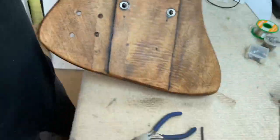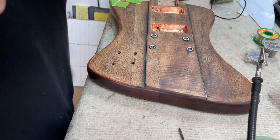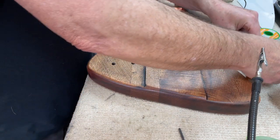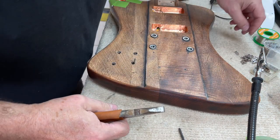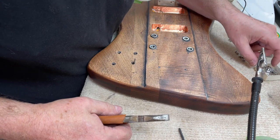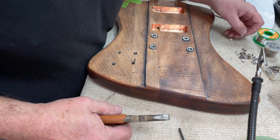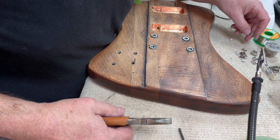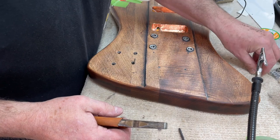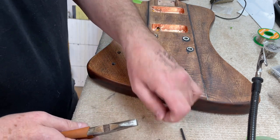ground points. And for that matter, what I use for ground points is a piece of metal that is completely useless, that I don't like, that I've inherited from other guitars, and it's these butterfly string trees, which I really like reusing when it comes to ground points on other guitars. So I get a smallish one of those, a couple of them. Yeah, exactly small. Oh yeah, here's a small one. So two smallish ones, and I'll use them to solder these wires to, and then I'll screw them into place. But to do it,